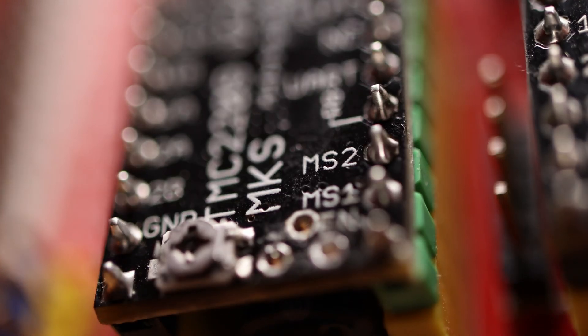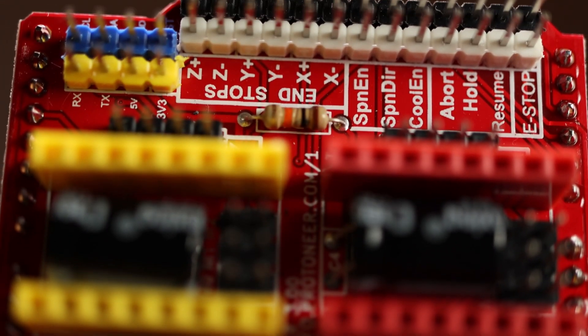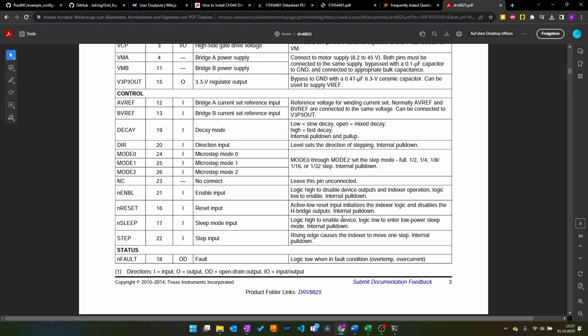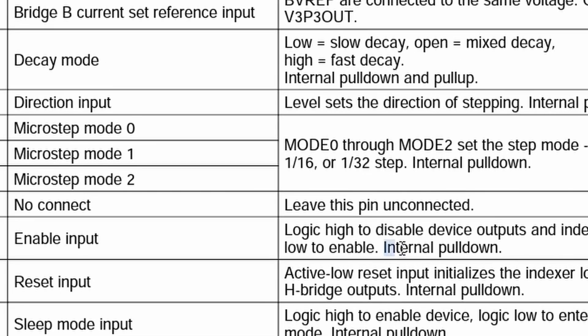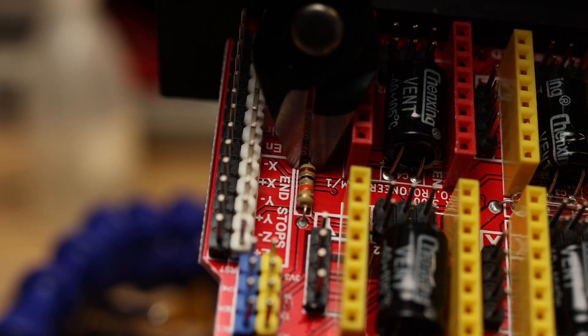But where was the voltage coming from? After all, this is an output pin used to drive the enable input of the stepper drivers. It turns out the ESP32 gives this pin a brief 3.3-volt level during boot to sense whether a pull-up or pull-down resistor is connected. The 10k pull-up resistor on the CNC shield tells the controller to expect 1.8 volts from the flash, causing the boot problem. But why does the DRV not cause this problem while the TMC does? A quick read of the datasheet confirmed my suspicion: the DRV8825 has an internal pull-down resistor which pulls the voltage low enough during boot to recognize the correct flash voltage.